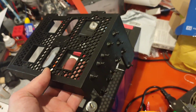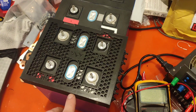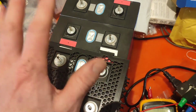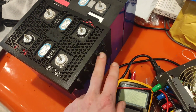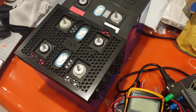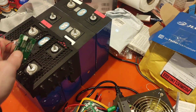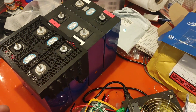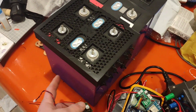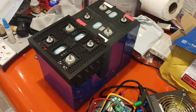I designed and 3D printed a cap for the top, which supports the cells and gives me somewhere to mount my BMS. It's got handy features: positives and negatives printed on it so I can clearly identify the terminals, and little mounting studs where my BMS cell modules, controller module, and relay board are going to sit. I've only got half the top case done as the other half is still on the printer. I'm also going to use aluminium extrusion to build a frame for the battery cells, which will contain the heater pad and an aluminium base to spread the heat from the heater pad.